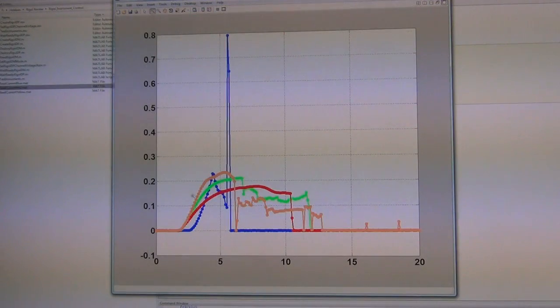And then if you continue and you don't care about that, you can see all of them shoot up to about 200 milliamps or so before failure happens. Once you reach this area above 100 milliamps, the diode is damaged irreversibly anyway. Even if you turn the current back off, it will never be as bright as it used to be. And they go up, and then they do some funny things here when they're failing, and then they collapse and become an open circuit again.